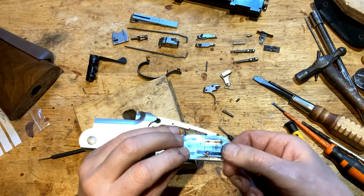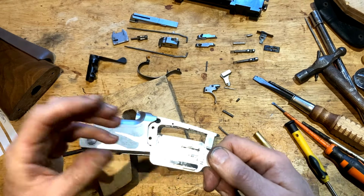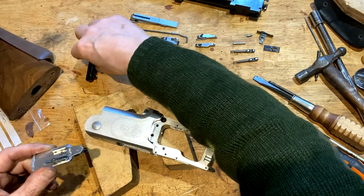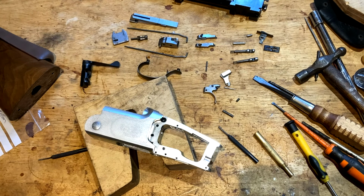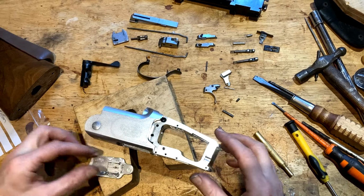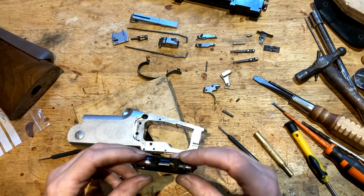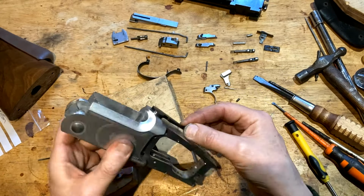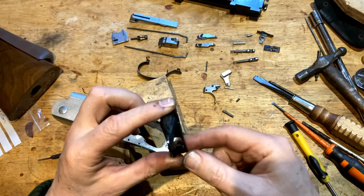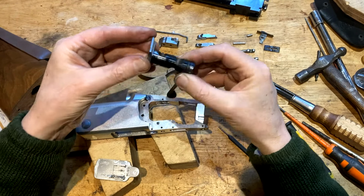Right, so this is the release catch right there with a little retaining spring, and that allows the top lever to operate. It operates down below like so when it catches on and catches off. Straightforward, not difficult. Yep, nicely made. I like it a lot. I do like it. So the top lever has all these tunnels in it to allow traversing of the pins and such like. Okay, so that's what indexes through to release the bolt. That's the way they work.